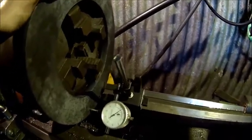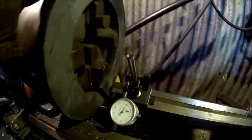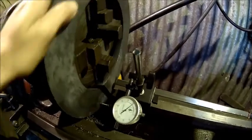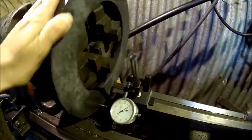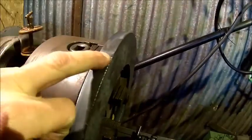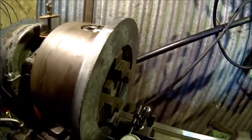We'll dial it in. It's laser cut, so it's about one tenth of a millimeter, which is fine. The outer diameter is a bit weird because there is a step here. I fold it a little bit equal, but you can see it's ramping up to that stage and then it falls down. So I'll dial it as best as I can.